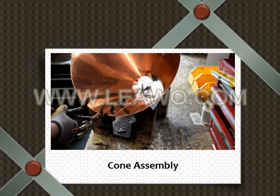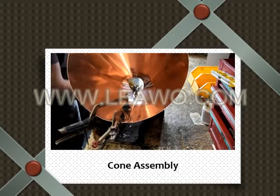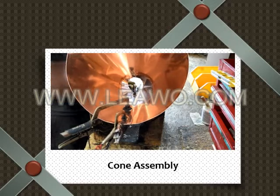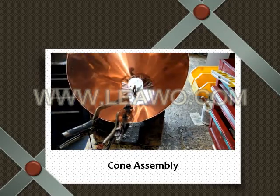You don't want to clamp on the seam because you're going to be soldering the seam. All your pieces that you're soldering are always from the inside. Don't solder them from the outside unless you're doing it for added security. Okay. One more clamp, the long clamp.